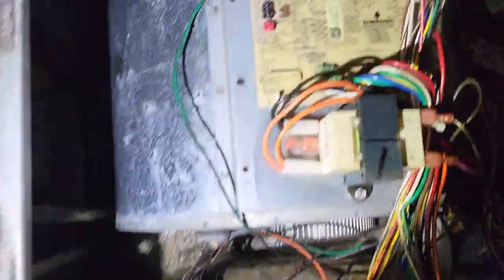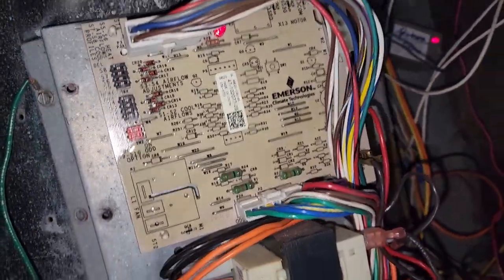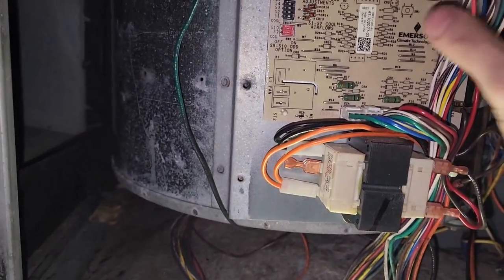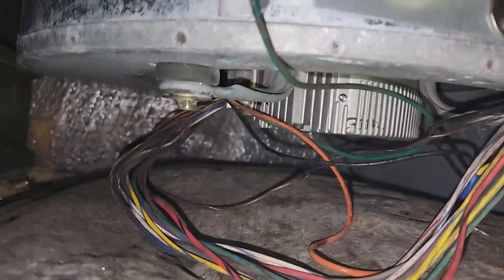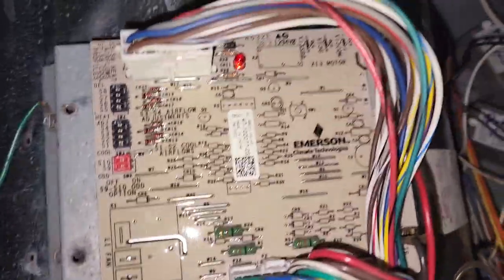We have our new motor in, and this is the old board. When I turn it on, our old board is responding and our fan turns on. So I'm going to leave this board in, because the board they gave me is not the right board. It may have originally been the right board and this may have been changed, but I don't want to start changing all the wiring if I don't need to. It's wired up to a fire alarm system, so I don't want to mess with anything and risk causing a bigger issue. I know it's working properly, and I guess the reason it hadn't been lighting up was because the fan motor just wasn't responding. I'm not exactly sure — I'm definitely going to ask Mike about it and look into it, but I thought that was interesting: once this fan works, the board works. It must be communicating in some way.